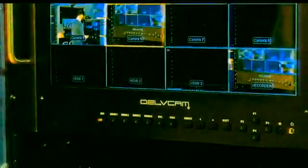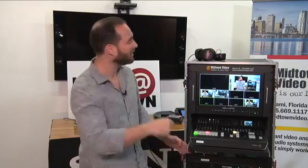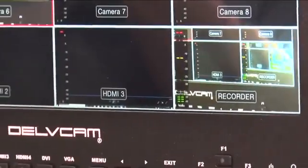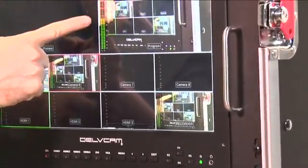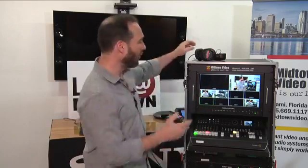You definitely don't want to cut to the recorder — look what happens, that's funky. It's just an efficient way of using the same multiview to double as your recording monitor. The feed goes into the Matrox for program, goes back out of the Matrox into my switcher for the exclusive purpose of monitoring on the multiview. Thanks to the audio meters on the multiview, you can see audio at the recorder and at program — though there's just a hair of delay since the program is live and the recorder is slightly behind. Make sure not to cut to your recorder source, and don't turn on embedded audio from the recording source or weird things will happen.